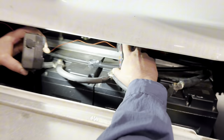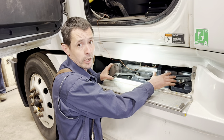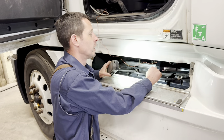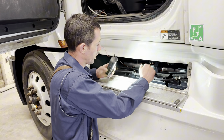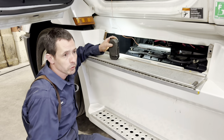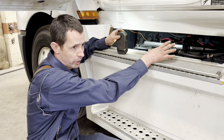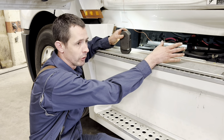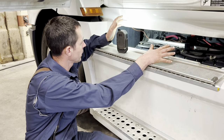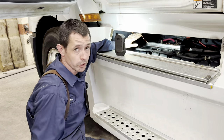If you're running full blast wide open, this battery system is a 400 amp-hour system — four 100 amp-hour batteries, 12 volts, wired in parallel. These are lithium starting and battery bank batteries. Running at around 20 amps, that would give you about a 20-hour capacity. Running wide open at 38 amps, it's going to give you roughly a 10-hour capacity.